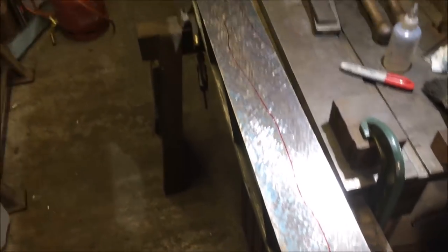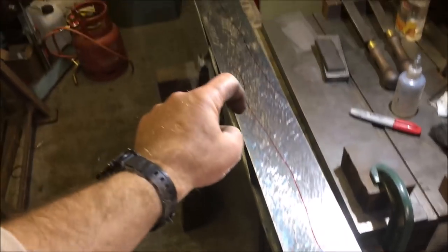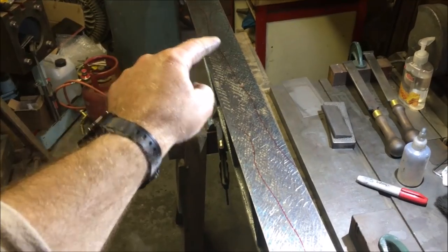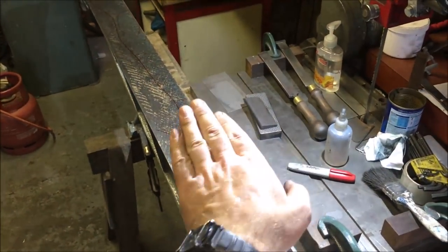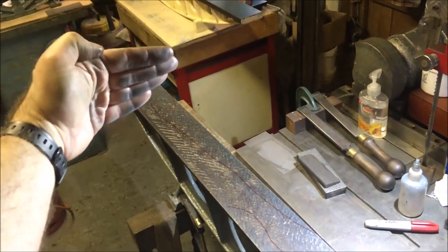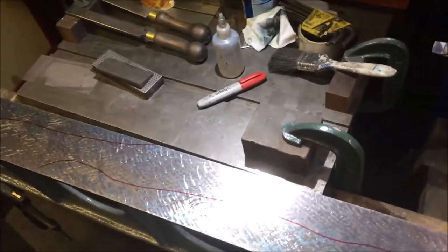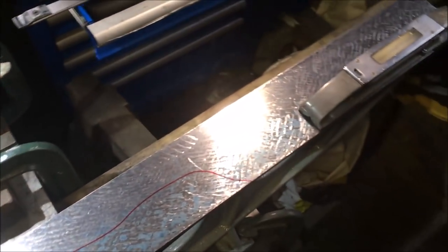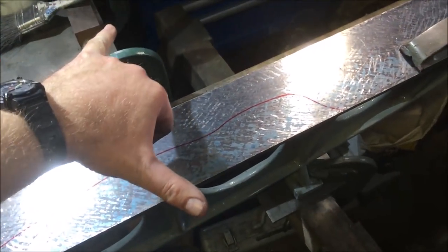the first print, which comes from around about there down, the area this side of the red line and the far side of the red line is printed, and then I've got a stripe up the middle, which would suggest it's all twisted. I've had the spirit level on it, and measuring it from the far end to the middle to this end, I can't determine anything more than maybe 2/10. It's down to, I haven't got a resolution high enough to go finer than that.